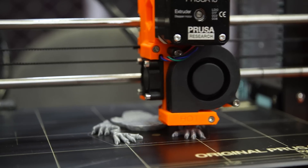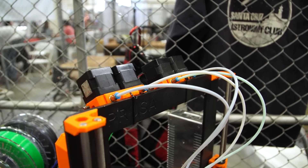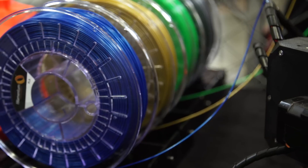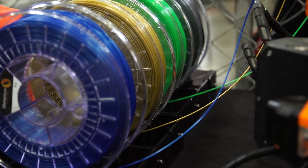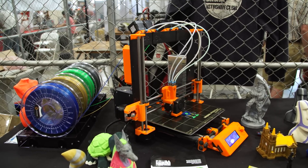This is an upgrade that's built directly on the i3, right? Yes, it's a simple upgrade. You can upgrade every Mark II or Mark II S. We just started shipping it this Friday — we got a little bit late because there were some bugs to figure out, but this is the release version. The idea is very simple: if you have a 3D printer with more nozzles, you have to always align them, and once the second one is not used, it oozes. With more nozzles, you get more troubles. So what we thought of is that we can actually use one nozzle, one extruder, and feed four materials. Not at the same time — we have the splitter here, which enables us to pull out the material which is not used and put in the new one. By doing this, we do not have to do any retractions or anything. It's perfectly aligned.